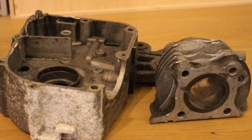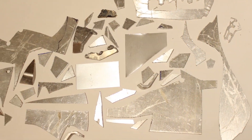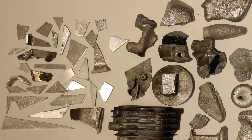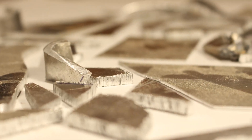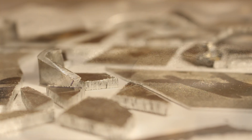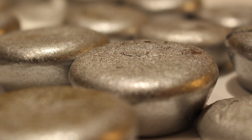The first step is to source aluminium, and ideally you want to get it completely for free or as cheap as possible, because if you're going to buy it for full value then you might as well just buy it in roundstock form and skip this entire process. If you want to create really high quality roundstock it'll be worth knowing what grade of aluminium you're using, but I'm just using various different scraps put together and it seems to work fine.